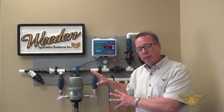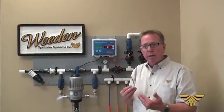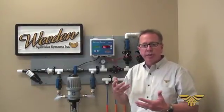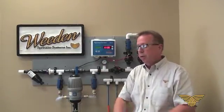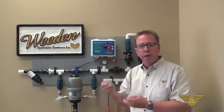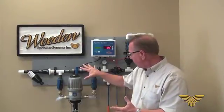New to the manifold in 2013, we've included a medicator bypass. The reason being is we have customers asking how to clean their system after six or ten years. By using this medicator bypass, you can drop the medicator right into a jug of ProxyClean, charge the sprinkler lines with ProxyClean, let them sit for 48 hours, then flush them out and clean all the biofilm which may build up over time inside the sprinkler system.